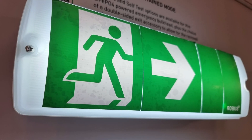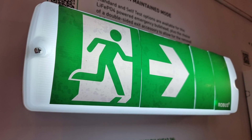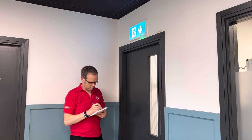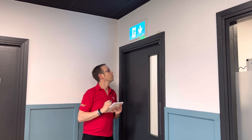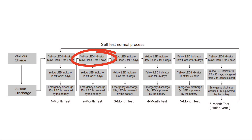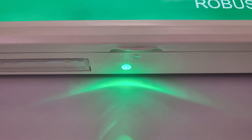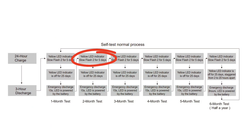If the LEDs don't work for some reason, it can tell this by monitoring and measuring the circuitry inside itself. But what if you as the inspector and tester don't happen to be watching during those 15 seconds — after all, you might have a hundred of them to watch at the same time? The light communicates that all is well by flashing a yellow LED, specifically following the pattern of on for four seconds and then off for one second. It does this for five days and then reverts to the usual comforting green glow. If one of the lights detects a fault with itself, it will flash the yellow LED very quickly — on for 0.5 seconds and off for 0.5 seconds — so you know to investigate further. The self-test will also carry out the longer periodic test, which we'll discuss in a moment.